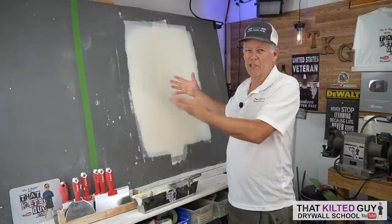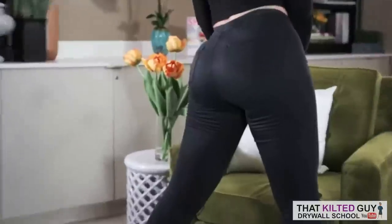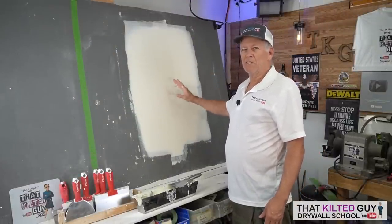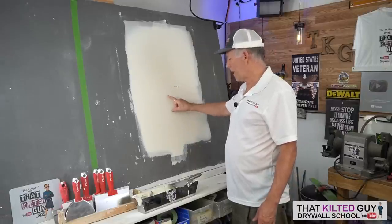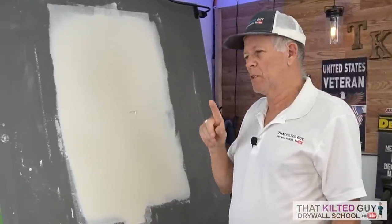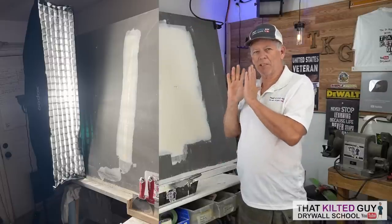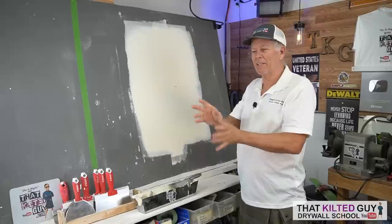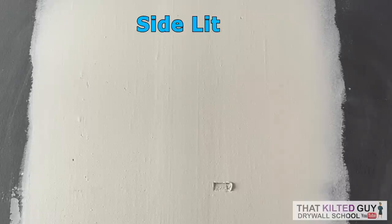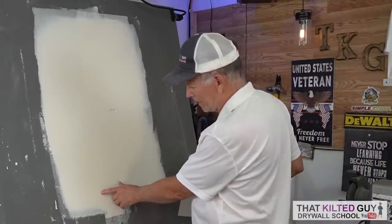On a flat surface with joint tape and mud, you're almost always going to have a little bit of a hump. One way to find out how much is to feel it; another is to side-light it. I've got a long light box on the side that concentrates light in a narrow beam, and I shined it down the side of this butt joint. It looks pretty good - you can barely see anything - but I just need to scrape off any tiny bumps.